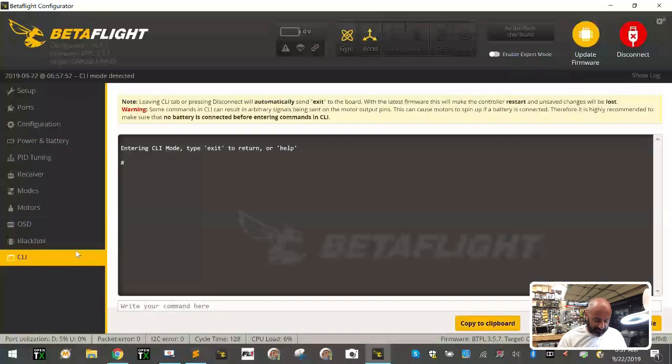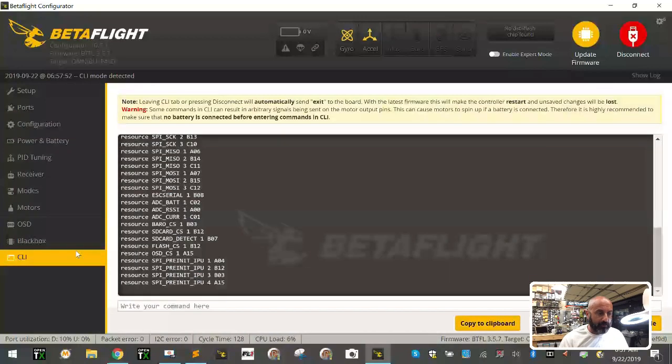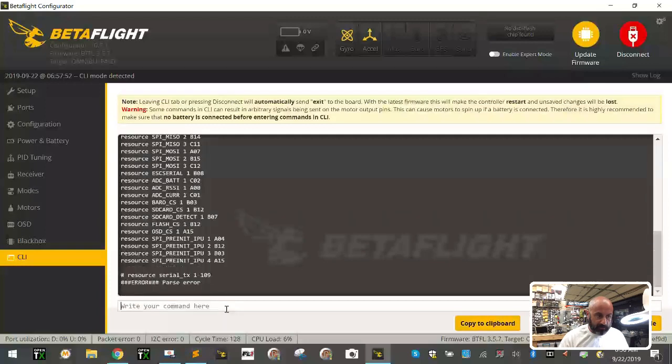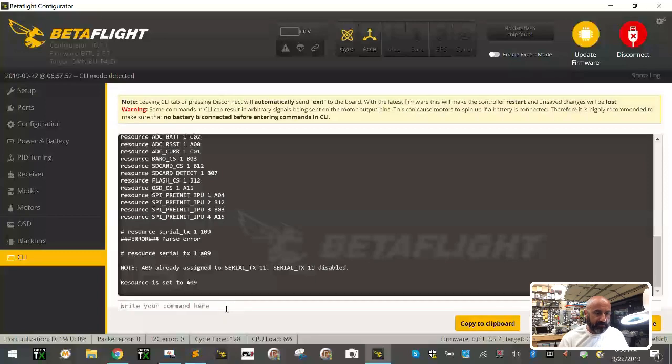Actually, we're going to go to our CLI, sorry. And we're going to type resource. And remember, we have to now get rid of that serial TX11, and we're going to put it back to serial TX1. So we're going to say resource serial_TX1 A09, right? Because that's what it is right here, TX1, yep. And we're going to hit enter. Oh, whoops, I forgot, I put 109, sorry. Resource serial_TX1 A09, hit enter, and then type save.